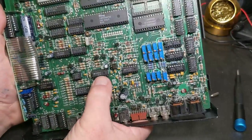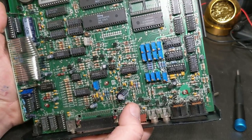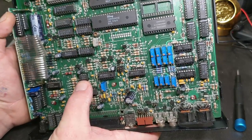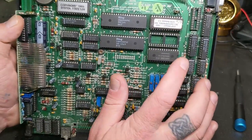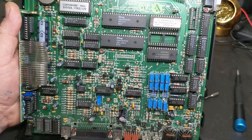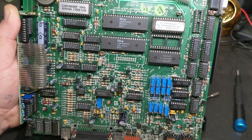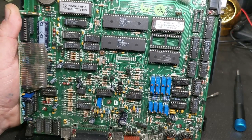Speaking of software - there's the modem chips, receiver and transmitter: 2206, 2211. There's an LM358, that's a dual op-amp. There's your firmware, RAM, I/O chip, CPU. A bunch of glue logic as they call it. This here is for an add-on option or something else - as I remember it being blank in one of the ones I had, maybe it was a 2400 baud modem.